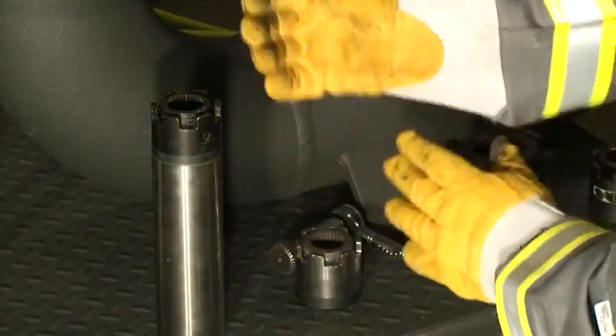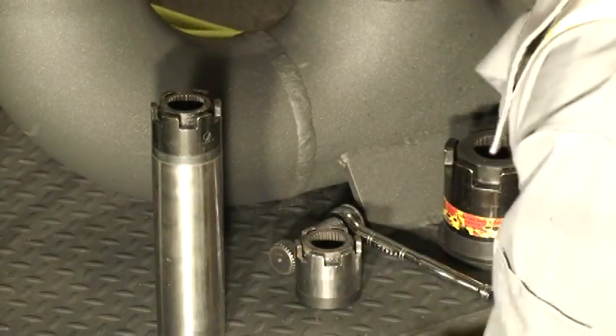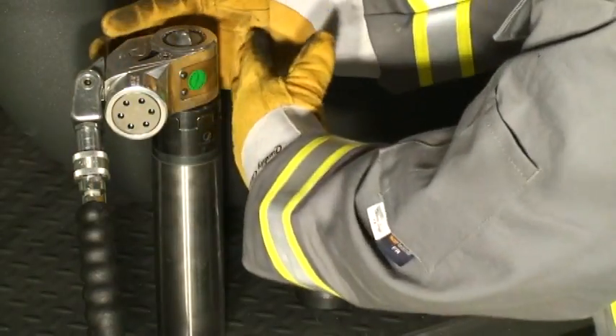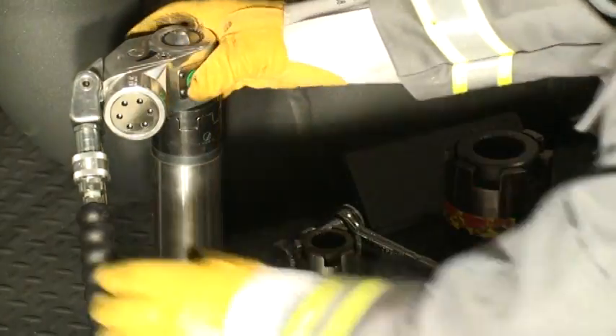This one's done. We've now put a straight axial stretch on that bolt — no side load, no torsion, no reaction points. And because we can position the tool 360 degrees around, you can understand how in a very tight corner with radius issues, this is where the clamp and the smart stud really shine.